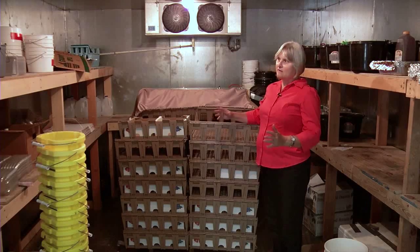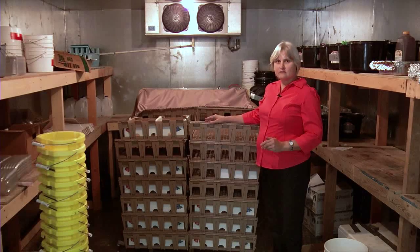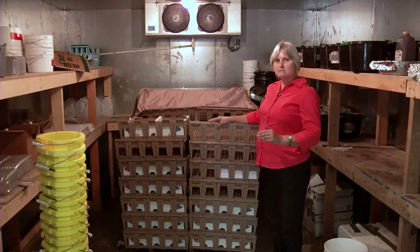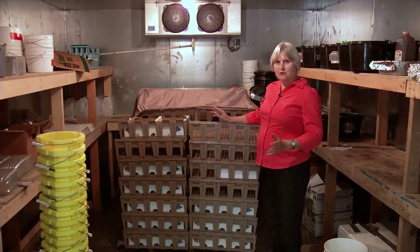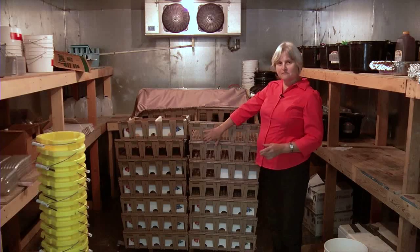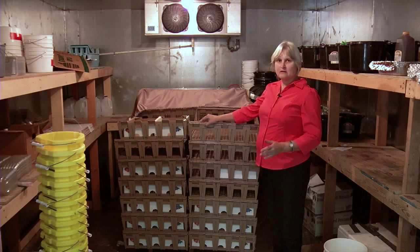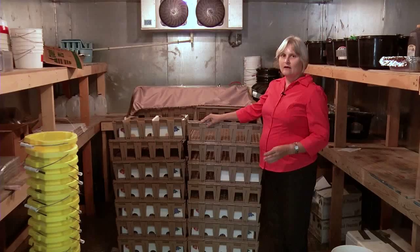One of the other things we have here is a forced air cooler. The most efficient way to use a forced air cooler is inside a room cooler like this. We wanted something that would give us the kind of air movement needed to go through a whole pallet or a half a pallet of fruit and get the temperature down as quickly as possible — within six to eight hours.